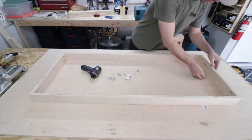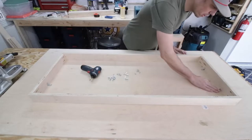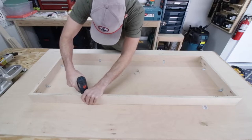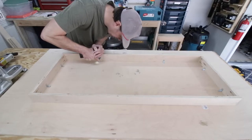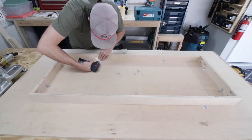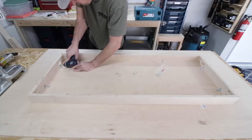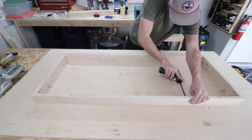After the rectangle was done, I laid it out so it was even on my table, then I grabbed my one-inch L brackets and spaced them around. You could use pocket holes for this as well — I just didn't want to risk any of my screws popping through the top of the table. I felt the L brackets would work just fine. I did put a longer drive bit into my drill to make it a little easier to screw those fasteners in.